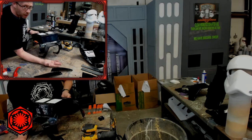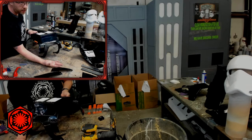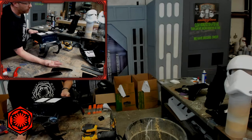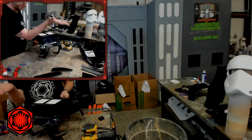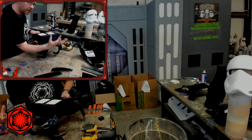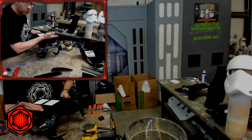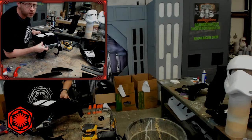Whether it's a heated mold or not, we have experimented with this. I've been vacuum forming since 1998, so I know just a thing or two about it. The mold is down here, the plastic's being heated, our plastic comes over, and then the platen comes up, stretches the plastic, the vacuum makes it seal, and sucks all the plastic down. Now, while that plastic's made a stretch, it has instantly cooled right here at the sharp corner of the mold and pulled that already cooled plastic down to right here.